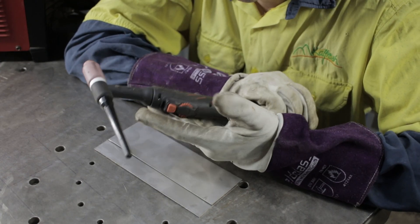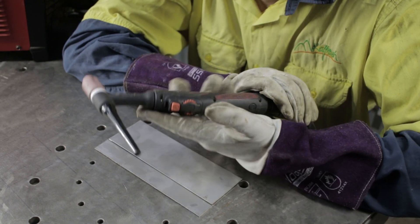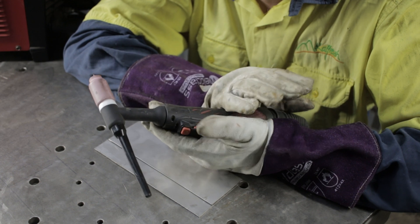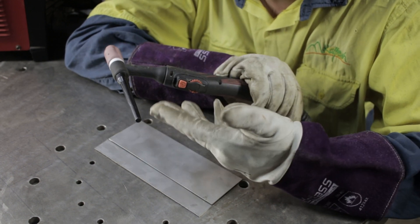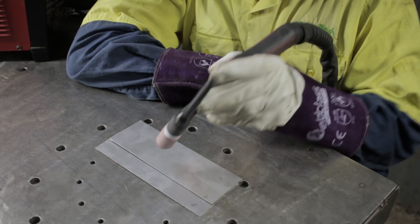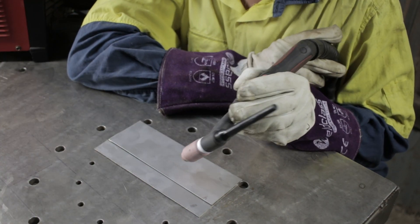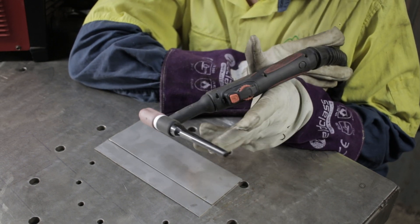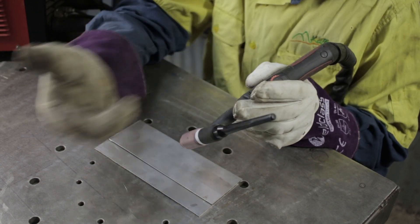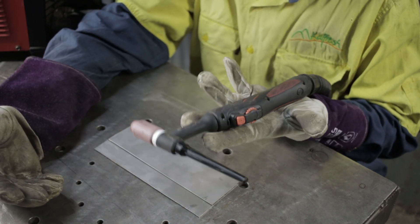Let's talk about technique. If I could reduce everything down to one word that's going to really help you, I would have to say it's stability. How stable you are is going to be the make or break in regards to your TIG welding results and how neat it all is. Because at the end of the day, the art of TIG welding is basically the ability to move very, very slowly, very, very precisely, very, very consistently. All those things come into play, and the biggest help is you being comfortable and your hand being well supported and stable.